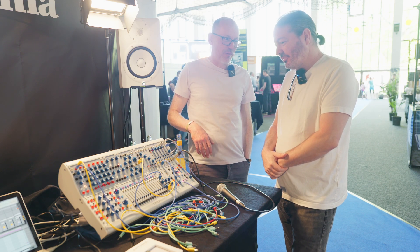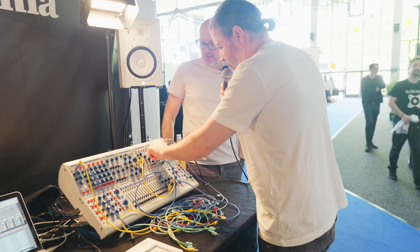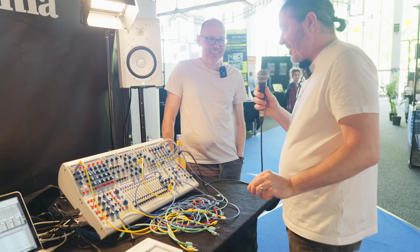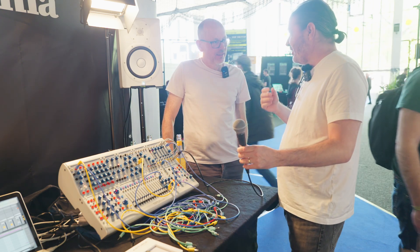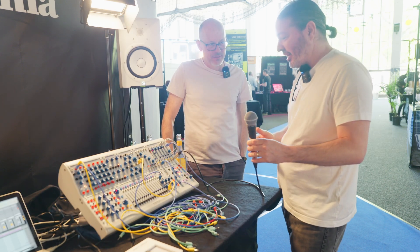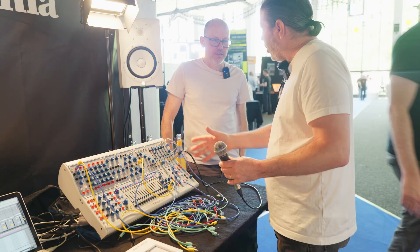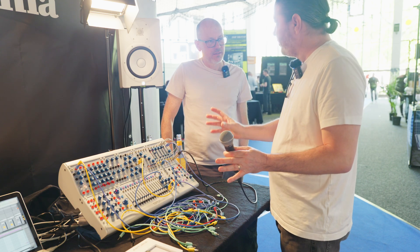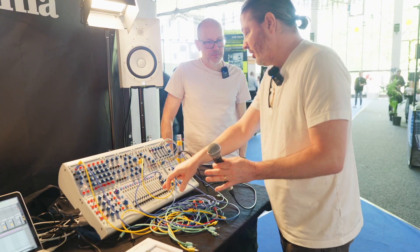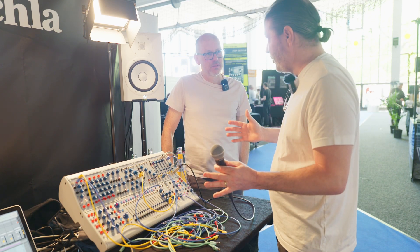I'm hoping I can persuade you to give us a quick demo now. So let me give you a little vocoder patch. You can immediately hear sounds that you would hear in Hollywood movies from the 70s and 80s — things we grew up on. This is such a classic. The vocoder patch I'm doing right now uses the even channels to control the odd channels, so it basically breaks the device into two sections of eight bandpass filters. The reason all these bandpass filters and CV inputs are here is to use two units and patch all the envelope followers into the CV inputs of the other unit for a true 16-band vocoder.